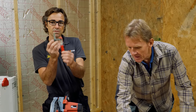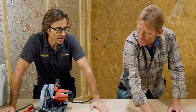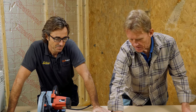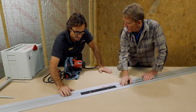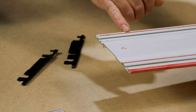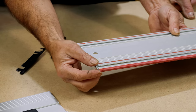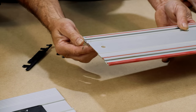The way this works, they've got non-slip rubber fitted into the bottom of the track — not just bonded on. With some rails, as soon as dust gets underneath it won't stick back and you have to tear it off and replace it. The grip is pretty good; I find there aren't many occasions where I need to clamp it. I might clamp it if I was doing a really nice quality oak door and wanted to take a sliver off, but for OSB, MDF, and P5 chipboard, the rubber grip handles it well.